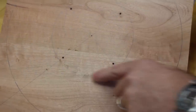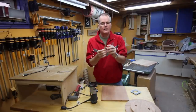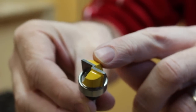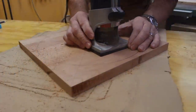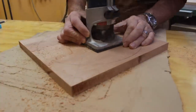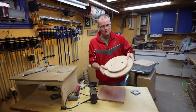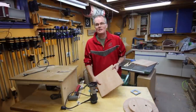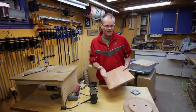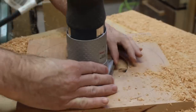Next I'm going to excavate for the bearing using the router. I have a bottom-cleaning bit so the cutter goes right across and should clean out the bottom nicely. I'm doing it freehand — only in the base piece, not the top — because there's really no reason not to. The excavation is hidden between the two pieces of wood, so nobody will see if you wobble off the side a bit. You could set up a nice template for a perfect circle or use a CNC, but there's no reason for it — just do it freehand, slow and steady.